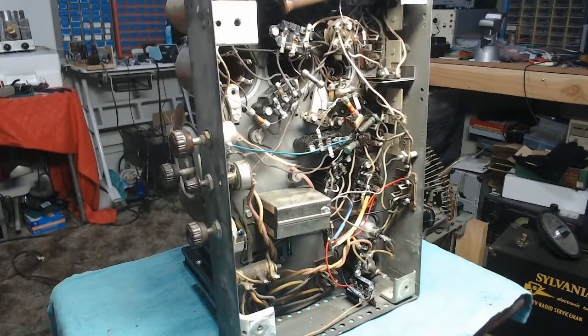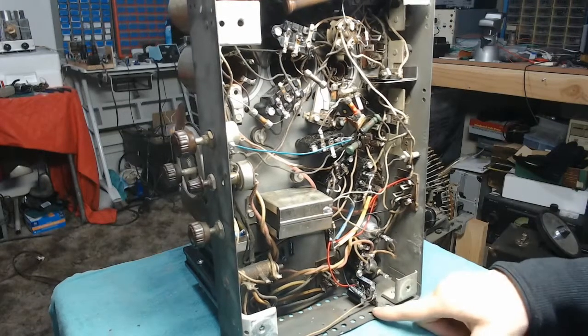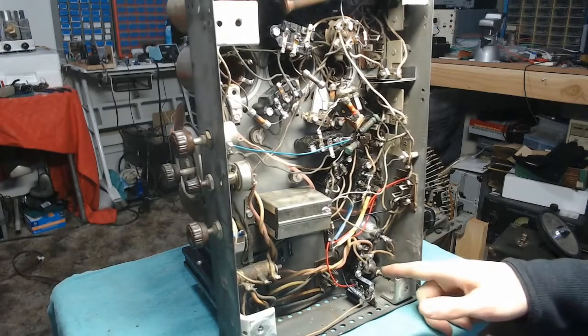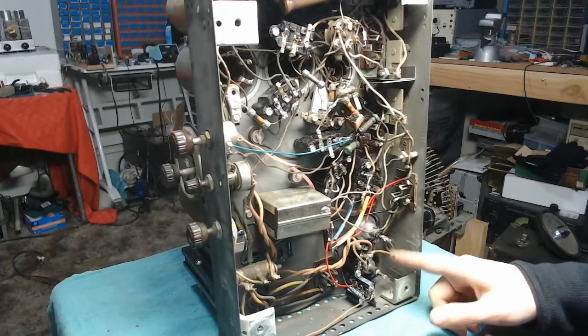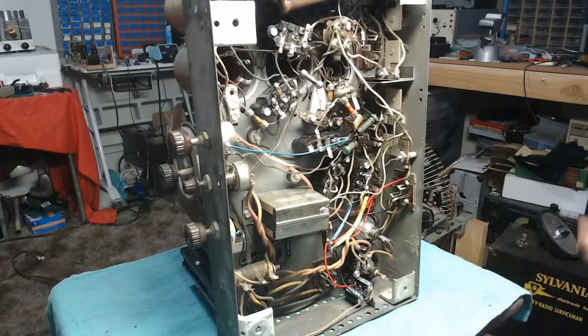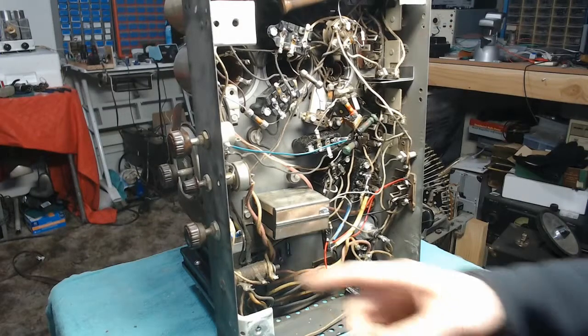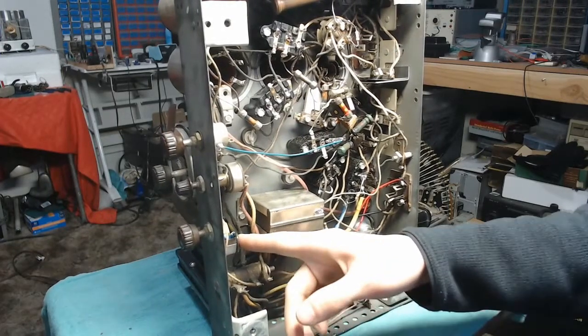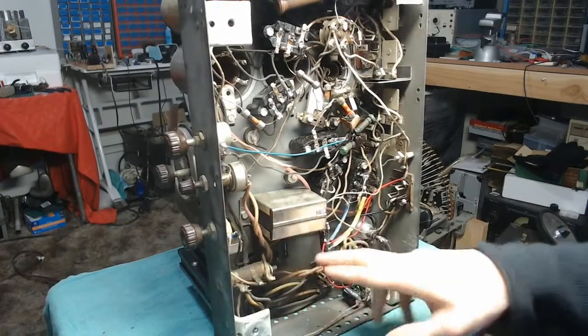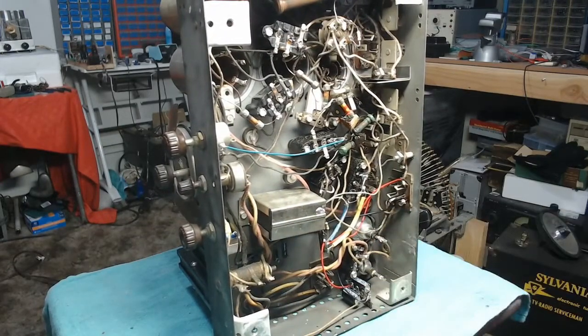Chassis here. All of the Bakelite blocks, as I said earlier, have been restuffed. New safety caps, new electrolytics down here on a terminal board, completely disconnecting the positive and negative terminals of both of the original, the big guys on top here, replaced with equivalent 8 microfarad 450 volt caps. And I also got the tone control put back together with new capacitors in there too. Got a new piece of wire hooked up that's not crumbling.